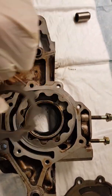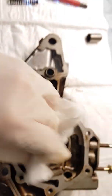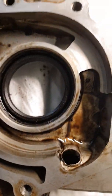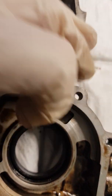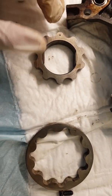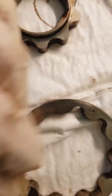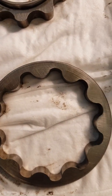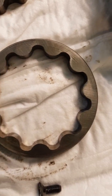These cogs just pull out — then you've got the big one. Taking a look inside, straight away you can see score marks both on the top side and down on the bottom. I can put my finger in there and literally feel the grooves — I can scrape away at things. Which means the other side of these is going to be chewed as well. There's a little bit of mark on the small one, nothing much. But this big one is going to be the one touching everything — and as you can see, very big score marks running outside. This thing's toast.